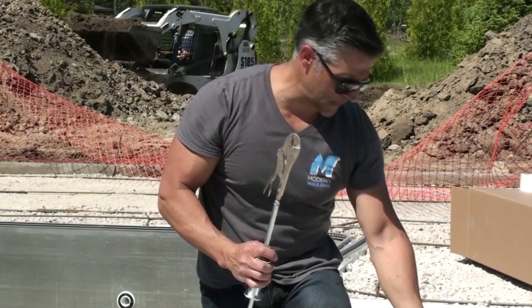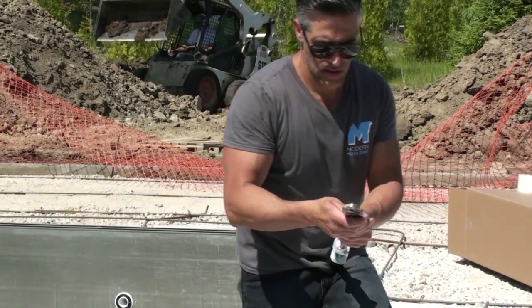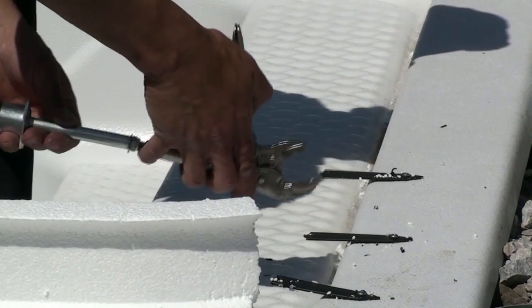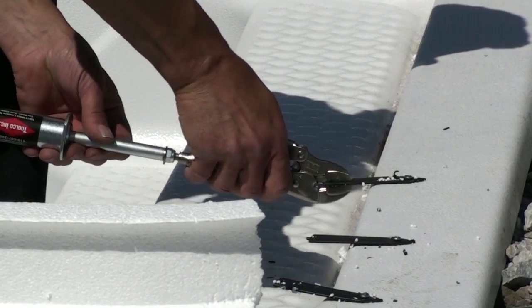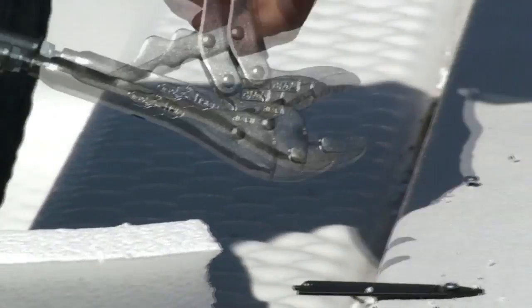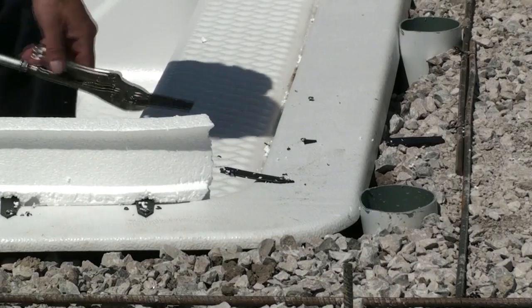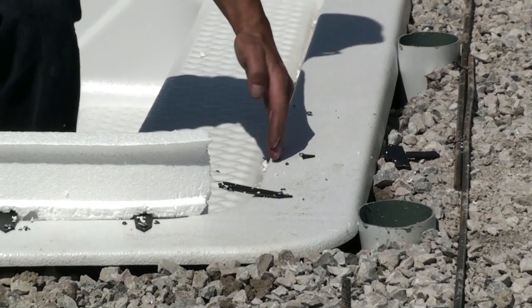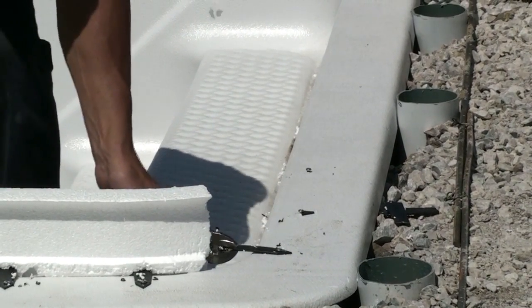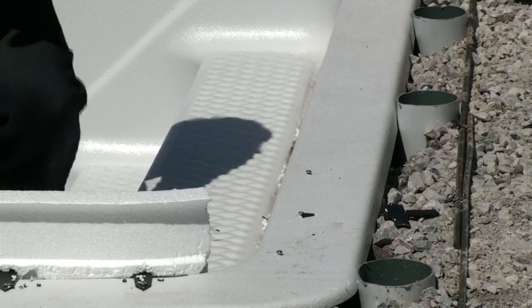And you want to get a firm grip on the clip. The way this thing works is just a little slide hammer. This will slide back and release the clip here. I'll show you. So you see it snap right off. Like I said, you created the weak point where the screw is. This just clamps on there and snaps right off. So again, nothing will be exposed because your concrete's going to be out past the screw. You won't see any wires or any clips sticking out. It's that simple.